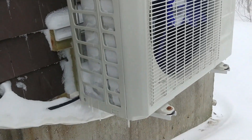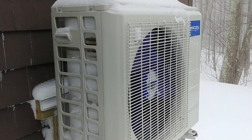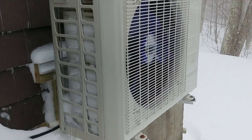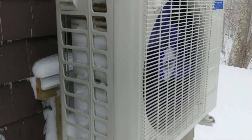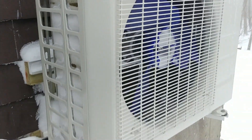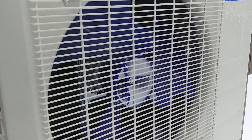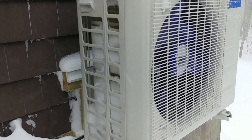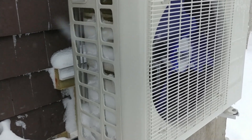I guess what I'm curious about is if it knows anything about this or if it's all just an algorithm. And then the other question is, regardless of what it knows or doesn't know, how effective is the defrost mode going to be? And it's clearly melting it. So right now what it's doing is it's running the compressor in air conditioning mode with the fan off, so it's generating heat in the condenser coil and the inside fan is also off. Although I guess turning that on would make this even more effective. Yeah, you can hear the compressor.